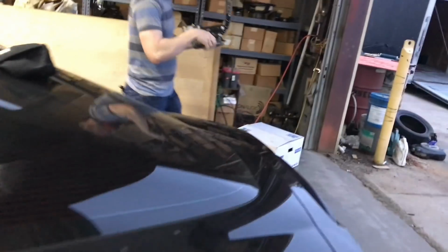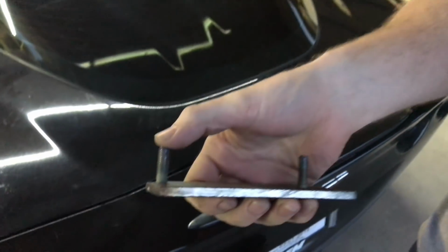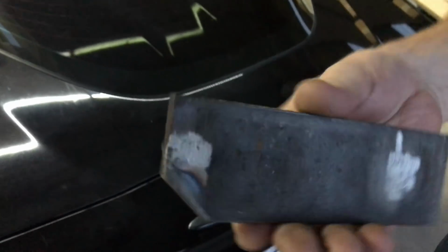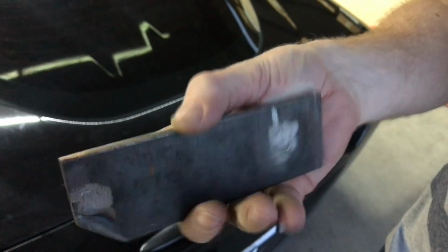Not mounted yet, but I did make it. You made it. What's the mount look like? So we're gonna weld this to the tunnel over there. I just took 2 bolts and put them in a drill, chucked them up, made them the same size as my holes, dropped them in, then welded it from the back and sanded it flat. That looks absolutely gorgeous. Came out pretty good.